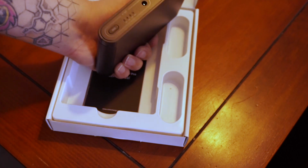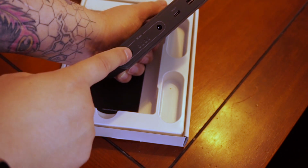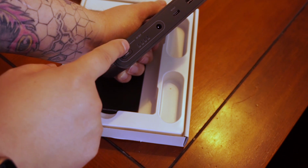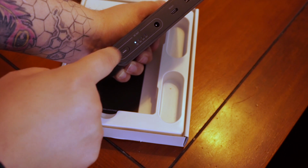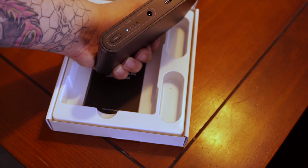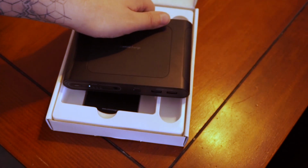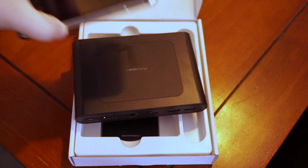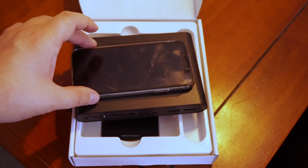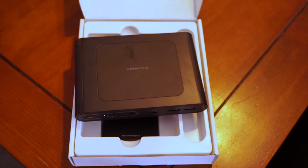You can easily change the voltage from 12 to 16 to 19 to 24 by using the power button and voltage selector. Speaking of the power button, it feels like it is the worst quality on this whole power bank. The button feels super easy to actually engage. If you're pressing it, you barely need to touch it for it to register you pressing it. What worried me about this was that maybe if you have this power bank in your bag and accidentally get a bump, it will shut off, but the on and off function is only activated if you long press the button. If you double press the button, you will enter the DC output mode, and then you simply single press the button for selecting your desired voltage.